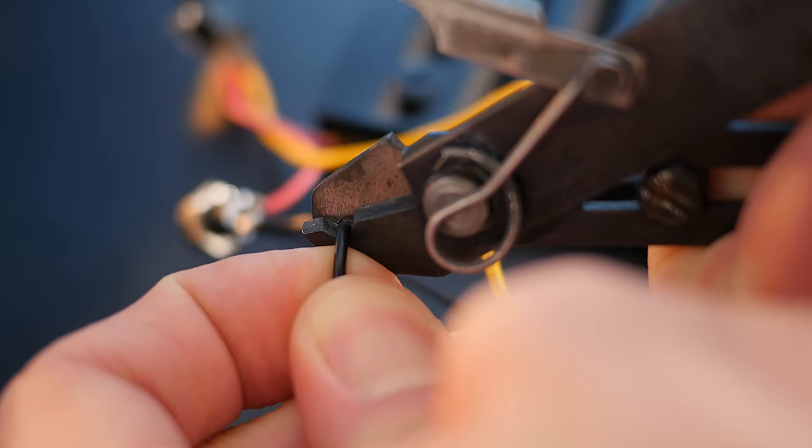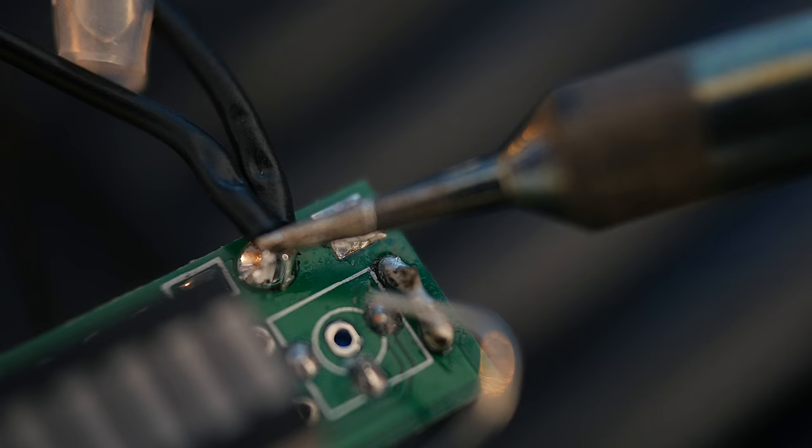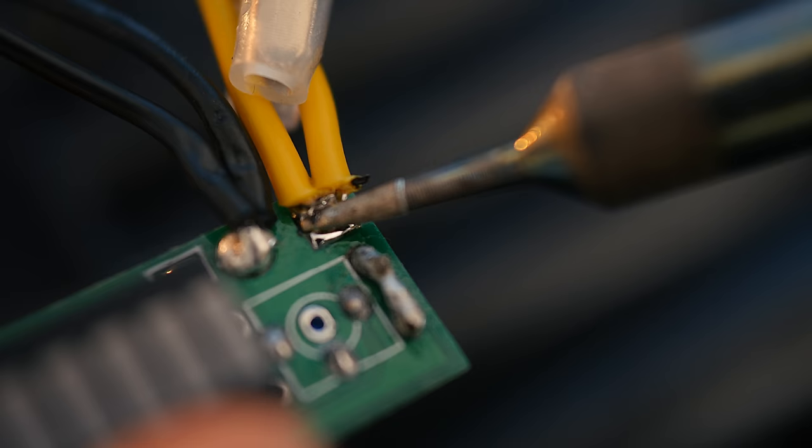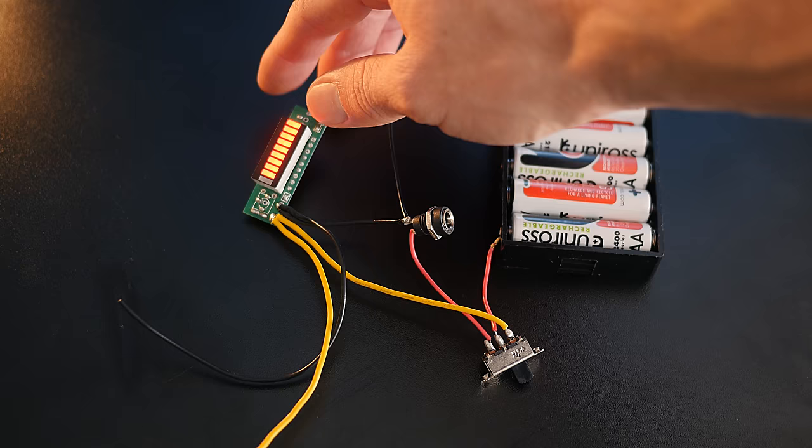We'll now expose a small section of the spare black wire and solder it to the negative power input pad, as shown here. We can now follow it up with the yellow wire on the positive input pad. When turned on, it should light up, but you will need to calibrate it to show the remaining charge time accurately, and you can find a guide on how to do that in the description.